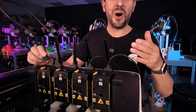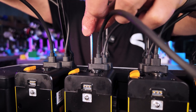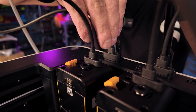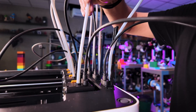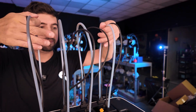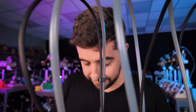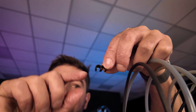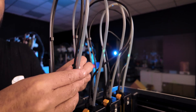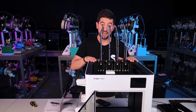After going through all those screws, connect the connectors and screw them again. Now it's time for the larger PTFE tubes. The only thing to be careful about is not putting the PTFE tube inside another cable — I almost did that by accident. Now we have the little clips to secure the cable with the PTFE tube. There is a proper orientation: the side with grooves goes on the cable, and the plain tube side goes on the PTFE. This product is really well designed.